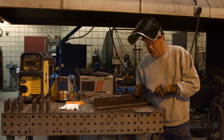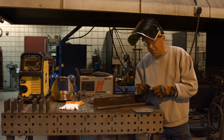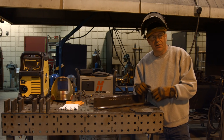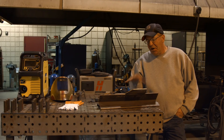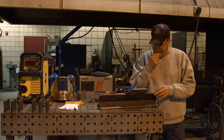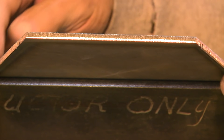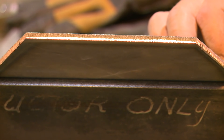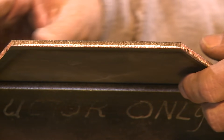Let me go cool this off. I'm just going to cool it off but leave it alone — I'm not going to clean anything up with the sander. I'm going to demonstrate how easy it is to zip these edges and make them straight and square and clean, and get them ready to weld. I went ahead and cleaned these off — I ran them on a 36 grit belt sander just to zip these off. I didn't spend a whole lot of time on them. This one is obviously just nice and straight and flat. There are a couple of them that have some minor chips in the kerf — still weldable.